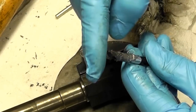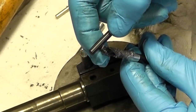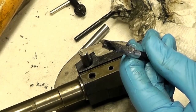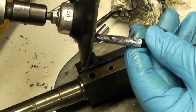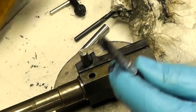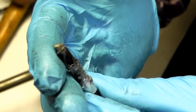If you leave it ground flat, you've got one flat edge pushing against another flat edge, and you want to knife-edge this - you want it to actually shear metal off and cut. So you are going to have to grind it back some. I use my sander for that. After you grind it flat, I slant it back and put an edge - I ramp it on the back side. I'm going to try to show you right now because this is the most important part in order to be able to do this yourself.